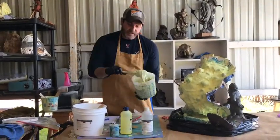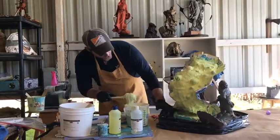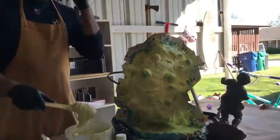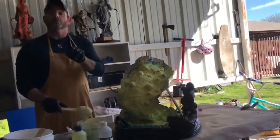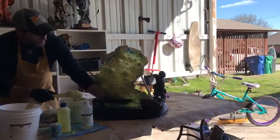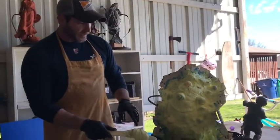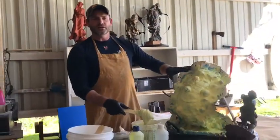This is the thick, heavy-duty thickening agent we need to fill in these holes — all of this undercut down here. From this point you need to consider your mother mold: are we going to do a two-part or one-part mother mold? I'm going to fill in some of these deep cracks and grooves to make our mother mold easy to get off. A quick tip: if you're casting in resin you have a lot more grace pulling molds off.